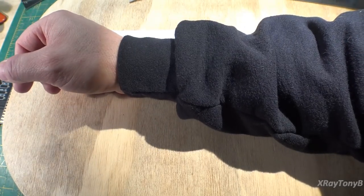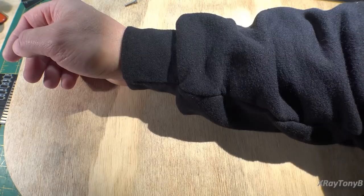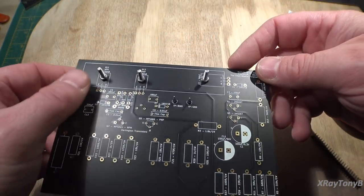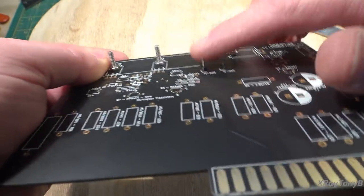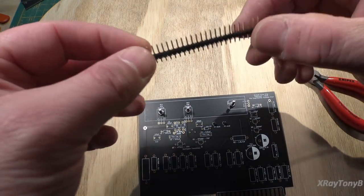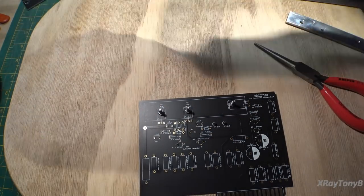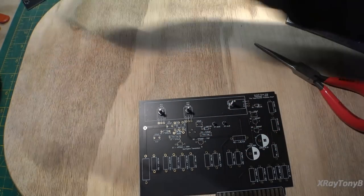By the way, it really doesn't matter what order you do these. I know people will comment that you should build from the bottom up and do the lower components first — absolutely true, you can do that — but on a simple project like this it's really not going to matter. Whatever is easiest for you, feel free to do it. These little test points were already mounted — I was trying some things out. They're just standard header strip that you can order on eBay or at an electronics parts house; you break them off into whatever size you want.